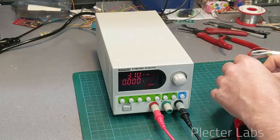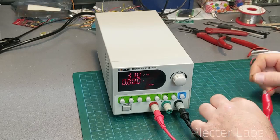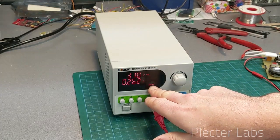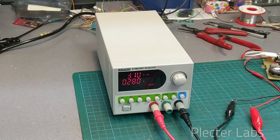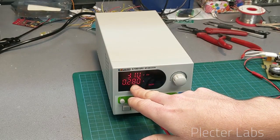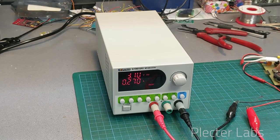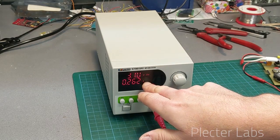The board booted because we are already in the on state — the indicator shows that voltage is applied. We are not in current limitation currently because we have up to 600 milliamps. So if I try to turn it on now, let's see what happens — you can see we reach CC, constant current, meaning we've reached the limit.